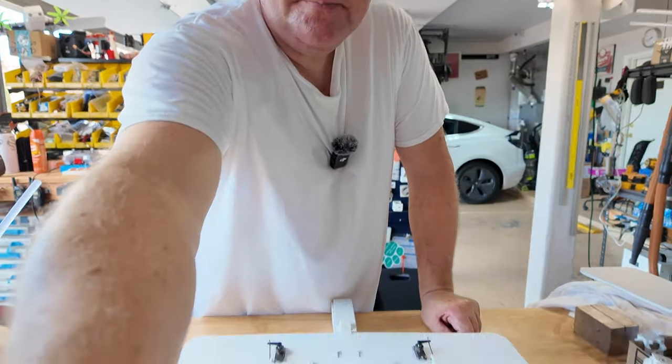It's a sub 250 build. You know, folks say, oh, hot glue's heavy and use super glue. You can use whatever you want, but I built this several times and haven't come out exceeding my 250 gram weight. So same thing, I'm just going to give those things a minute or so to set, to cure before we flip it over. I want to have those servos square and seated in there. So we'll cut back in a second.